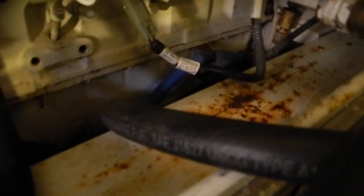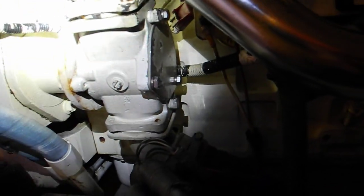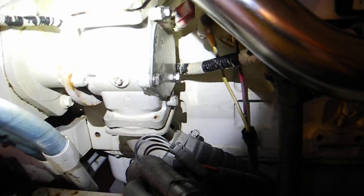After it picks up water from the bilge, it then goes through the strainer, then it follows the hose around and comes up into this raw water cooling pump right here. That's the raw water cooling pump that sucks the water up from either the ocean that the boat's floating in through that valve, or through the bilge through this valve.